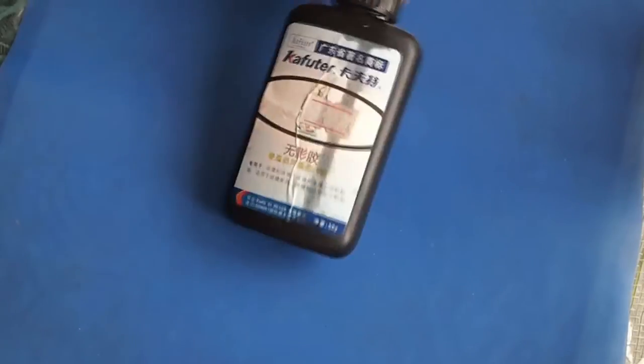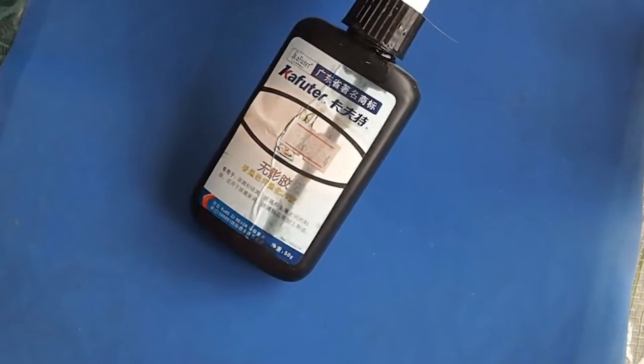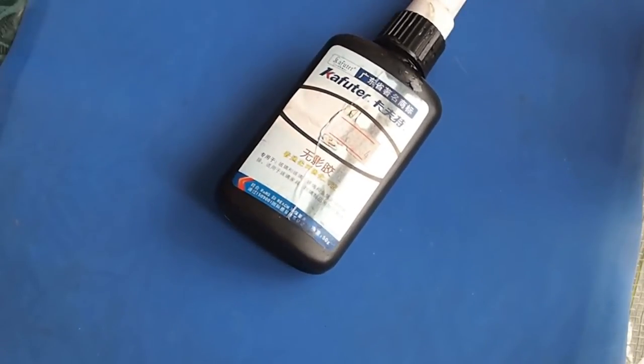And for my little side project of putting that tritium vial in, I'm going to use this UV curing glue that you fix your windshield with. It dries crystal clear and doesn't cloud over when you use it to cement things like a two-part epoxy would. The epoxy cracks and turns yellow and deteriorates with time, so this is the preferred stuff. You cure it with UV, which is good when you've got strong sunlight. If not, those little drying ovens that are used when you put your nail polish on, the glitter stuff, that'll work as well.